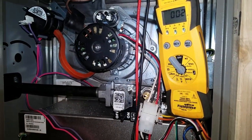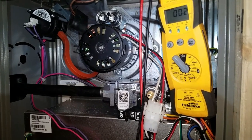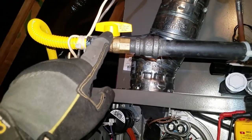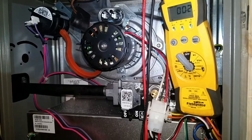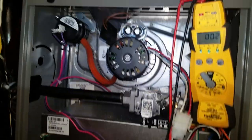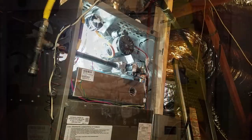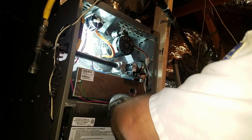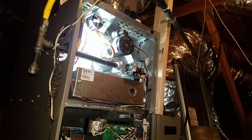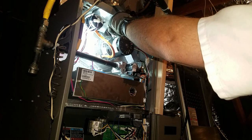So they're going to have to go without heat for a while longer, but at least now we know what's going on. Very surprising — I honestly thought this was going to be something else, like a loose wire, since it's the first time they tried to run it. Anyway, we'll be back with the installation. We're back — faulty inducer on a brand new system. Already unplugged, going to go ahead and swap this out. First things first, we gotta take the flue pipe off.